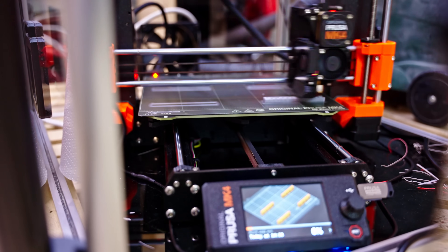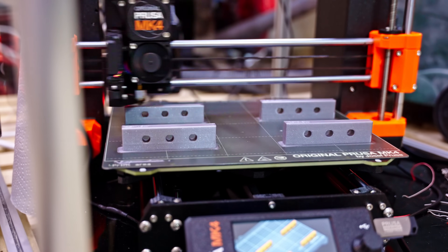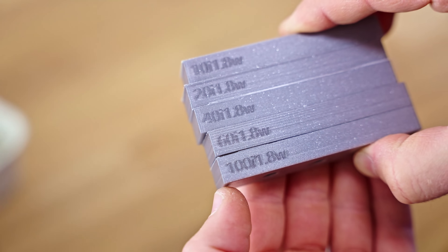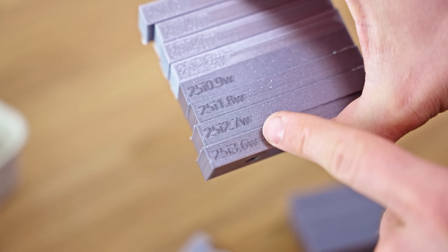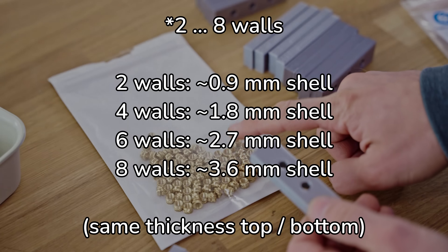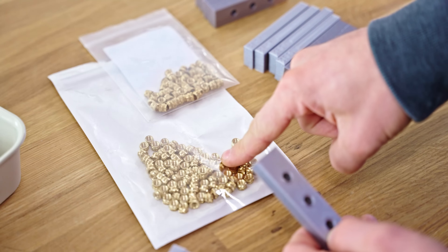For these parts, I grabbed some fresh PLA and I'm printing all these parts in sequence, which means it doesn't matter if I'm printing four or just one at a time — they always get printed at the exact same speed, and the layers always have the exact same time to cool down before the next one gets added. The first set of test parts goes from 10 to 100% infill, printed in both orientations — laying flat and standing up. The other set is printed at 25% infill, going from 0.9 to 3.6mm wall thickness, which is 1 to 4 shells. These parts are all for M5 inserts, and I'm using two of the AliExpress inserts and one from the CNC Kitchen short types.